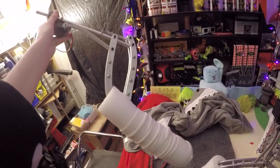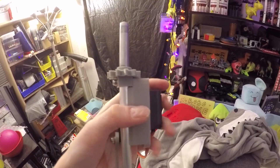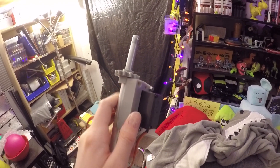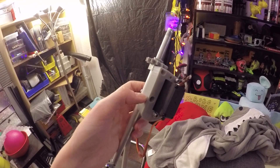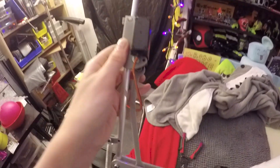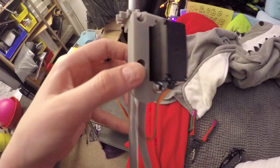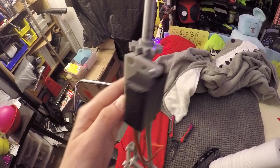This is a Noodle leg. There's the femur with the gear at the top. One of the other old parts that needs to be redesigned is this bracket right here that holds the lift servo. That's the servo responsible for pulling this tendon right here upwards — that makes the foot go up and down. It holds that servo onto the femur, and it isn't designed very well.